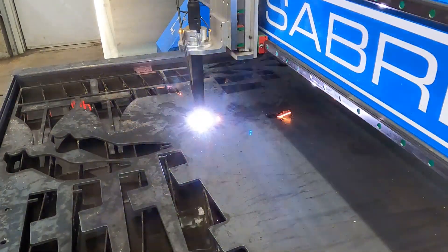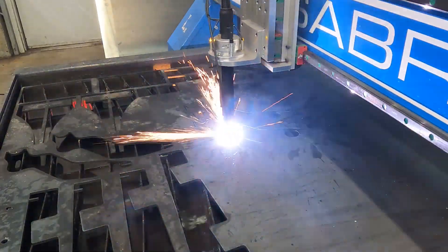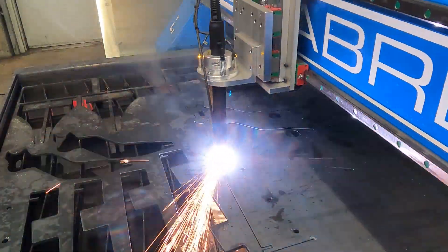I'm just using Corvette upper and lower control arms, so I got the measurements to base my design off of — honestly just measuring two other Corvettes. I got my measurements and realized where the articulation points are, and then from there that's how I started the design.